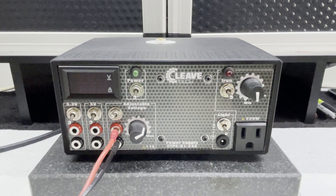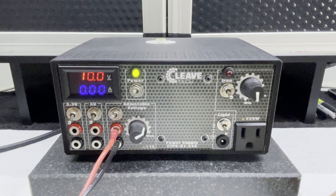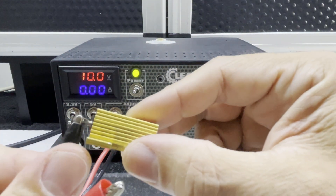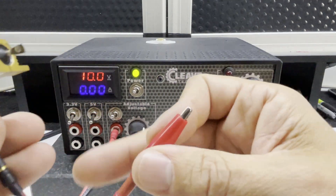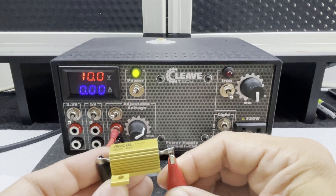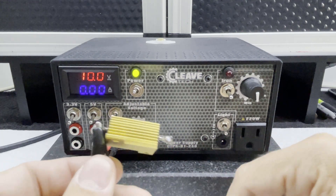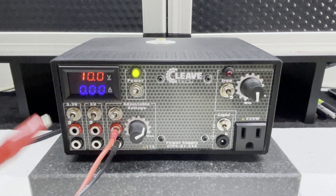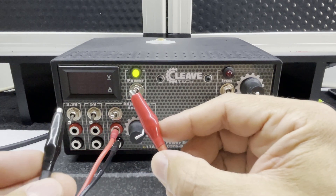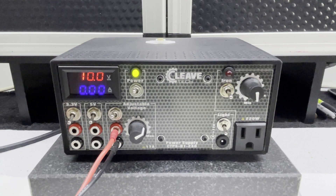Here is a quick demonstration of the current capability of the Cleavtech power supply. I've set the variable output to 10 volts with a resistor of just under half an ohm. Doing the calculation, I'd expect around 20 amps, maybe 19 accounting for wire resistance. There we go — 19 amps. I'll disconnect that quickly before it gets too hot. You can see that slightly exceeds the capability of the power supply, so I wouldn't recommend that regularly. But if you did have a complete dead short, it would just cut out — no more power, won't damage anything. Reset it by turning it off and back on again, and it comes back to life.